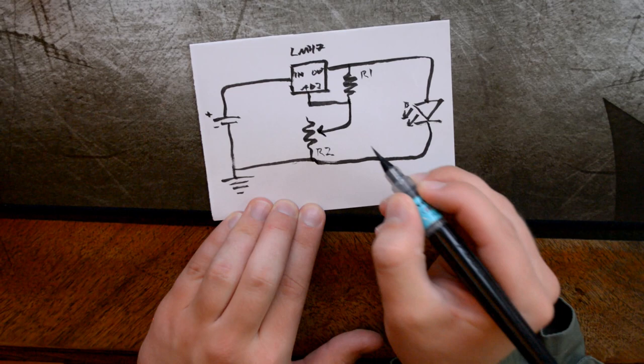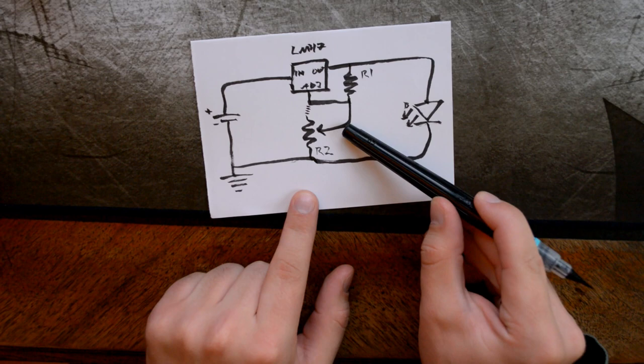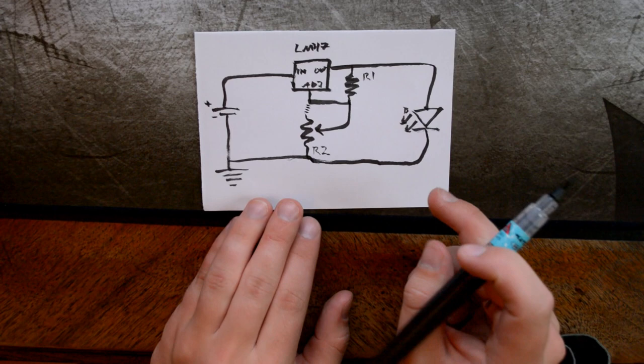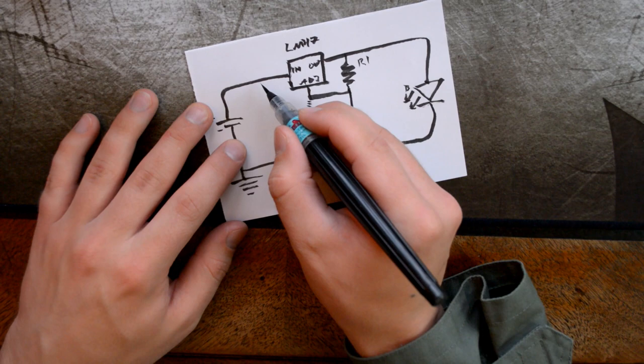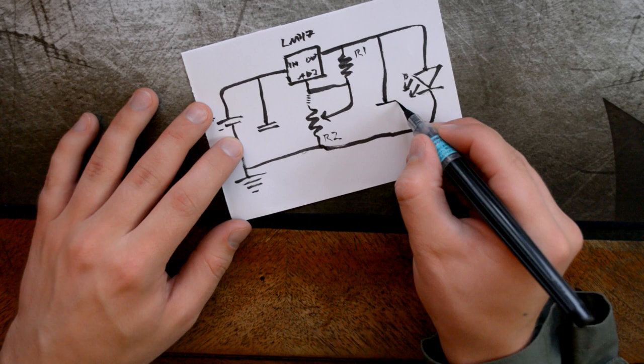And you can connect this if you want to, as explained before. If this is connected, then if this connection would break, it will output the maximum voltage possible, limited by the R2 resistor. Or if you don't connect this, it will output the minimum. What I added here that's different from the last time is capacitors, which we'll add here. There we have one capacitor. I'll draw them out here. I'll just take them down there. And we'll have capacitors here and a capacitor there.